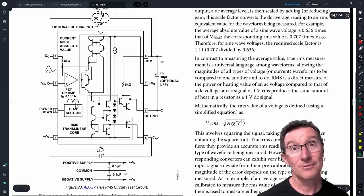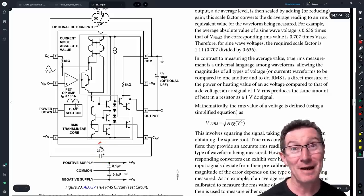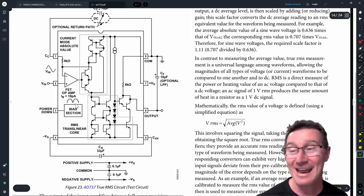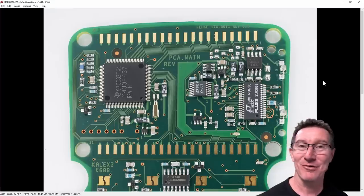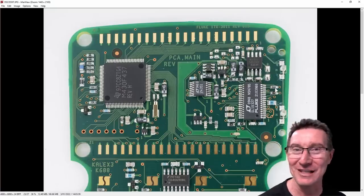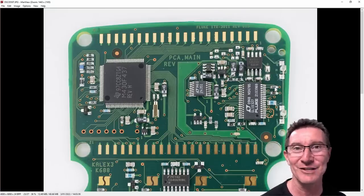So how do you convert it? It's real simple — you simply remove the averaging capacitor. If you do that, it basically passes straight through and you get average mode. So surprise, surprise, what do we find in our average responding Fluke 77? A capacitor right there — missing. The 33 microfarad capacitor. And that is the only difference between a Fluke 77 and a Fluke 170 series.